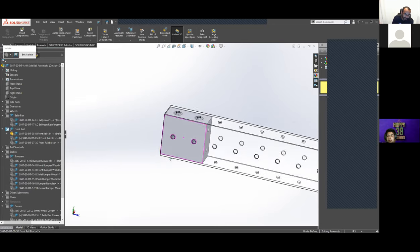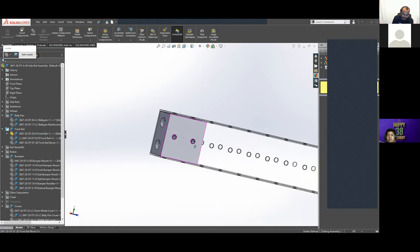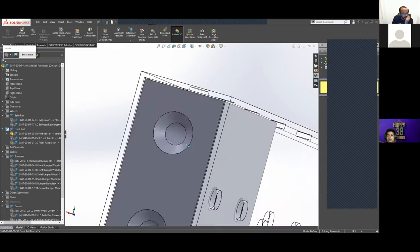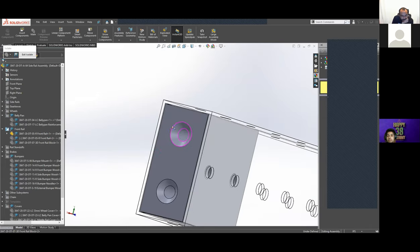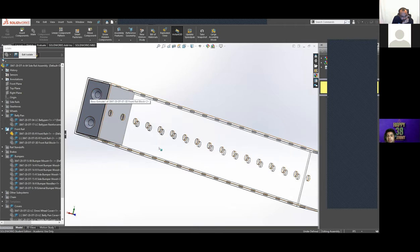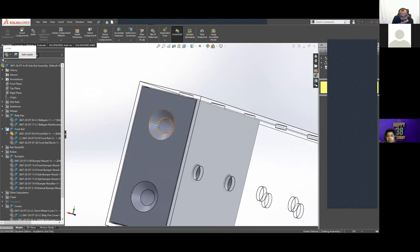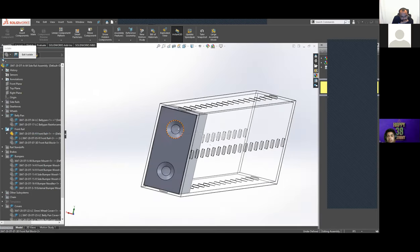Talk about the countersunk holes that are facing the same way, so you can actually insert the threaded rod. On the 3D printed block, there is a countersunk hole on one side. It faces the same way on both sides, because the threaded rod isn't ever actually straight, so you kind of have to force it in. It allows us to locate the hole easier and makes assembly a lot easier.